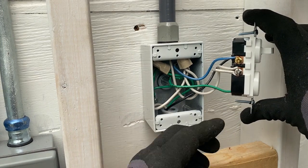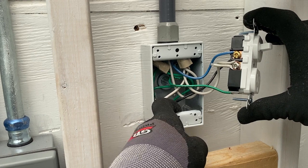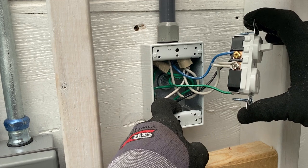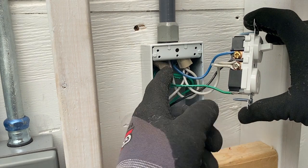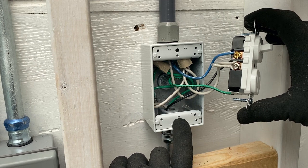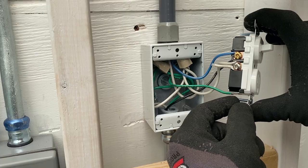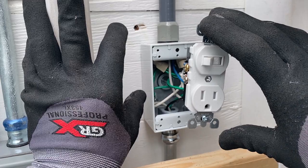I'm going to go ahead and install this device into the bell box. When you go to install it, you'll see these screws are long — you want to make sure you don't have any wires right behind where it goes into the hole. If your hot wire or neutral is folded down in there and you're on a GFI, you're going to have problems. It'll cut through the jacket of the wire, give you a short, or you'll be troubleshooting. Make sure your wires are out of the way of these mounting holes, or you can use smaller screws as well.